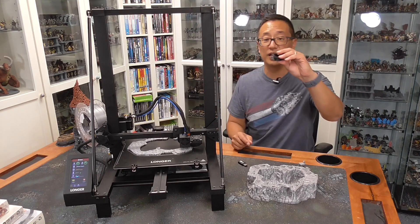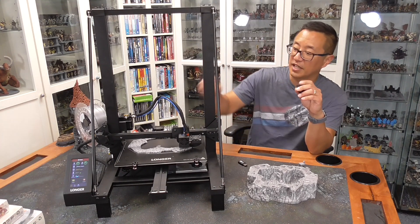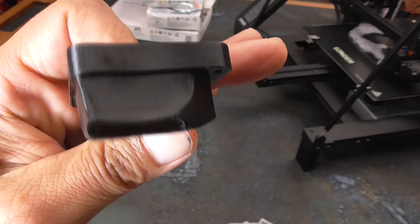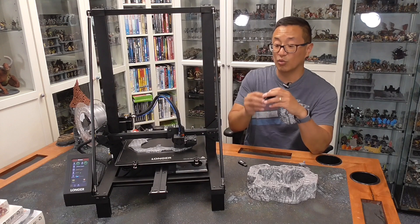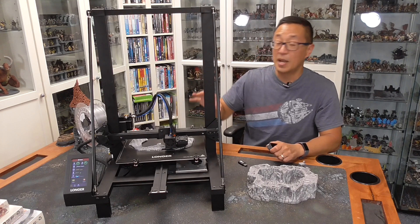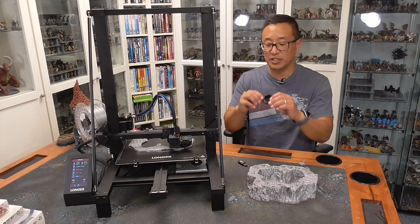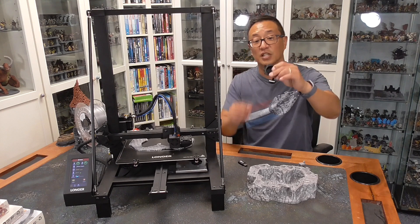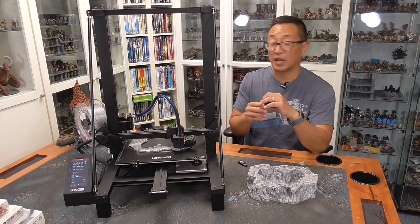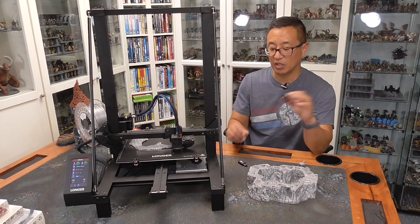One of the things I noticed is after I reprinted this, I did shrink it down and make it a little bit shorter. But the heat block is warping the shape of the nozzle part. So I've ordered some PETG and I'm going to reprint it and replace that. If you do get the LK5 Pro, I highly suggest that you print in PETG because the heat from the block was warping the PLA that I used. PETG should be able to handle that heat a little bit better. Also just increase your infill maybe to 30% or something like that — that will also help.